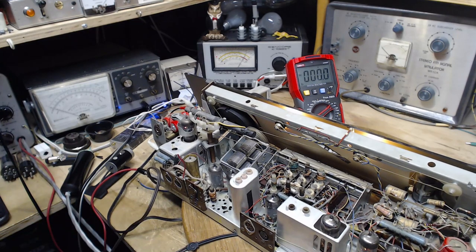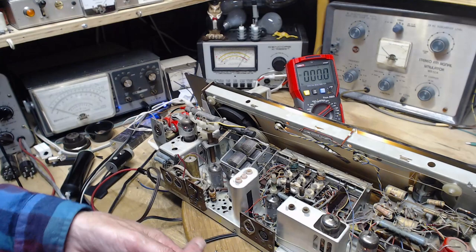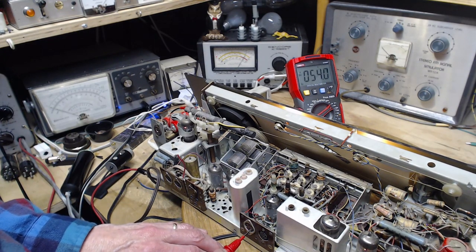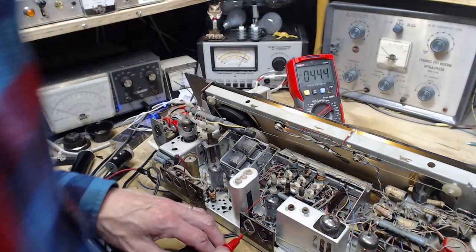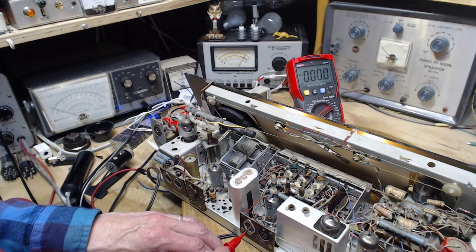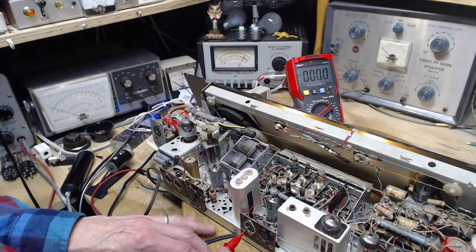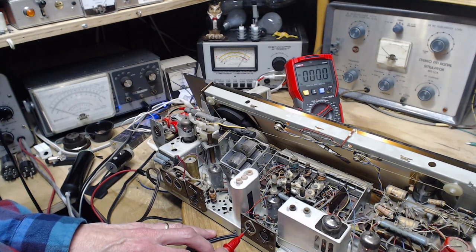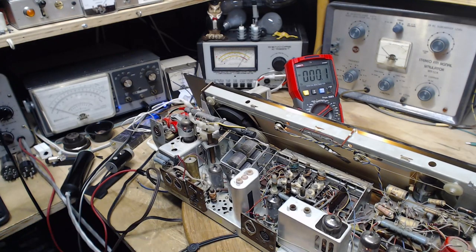Let's put the radio back on. I have the feeling the volume's up. Just tuned it to a quieter spot. Now we get the voltage. So when it's on radio, the voltage appears. Complete zero on these. Now that's interesting. Zero may indicate a ground has been placed on them. Okay, I think I got to study the schematic at length here and sort out how this is working. Oh, that was a bolt of lightning there.